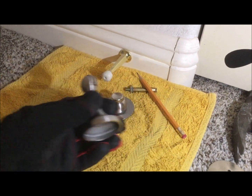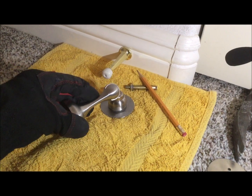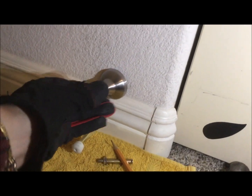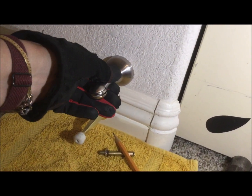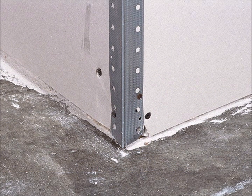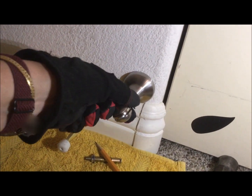I really like the idea of the magnet and of course it's more modern looking. My first step is trying to decide where I'm going to install it. I don't want to put it too close to the corner because the drywall has this corner bead or trim, and you don't want to be screwing anything into that. The drywall corner bead looks something like this, so I'm going to stay away from that and move it away from the corner.